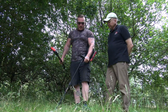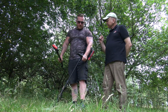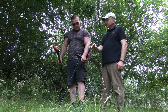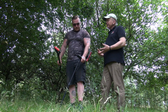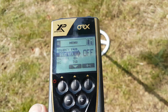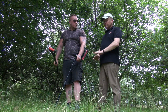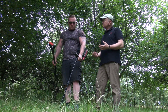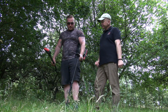So I'm getting a target here, Gary. It's reading 0.3, and the iron probability meter is at the top, and it's got the low buzz, so that's 100% iron. But if you didn't want to hear that low buzz, you could go into the menu and turn off the iron volume, so you're only getting the good target tone. And that would eliminate that iron sound completely? That would eliminate it completely, but personally I like to use the iron tone because it gives me that little bit more information. Yeah, you and me both on that.